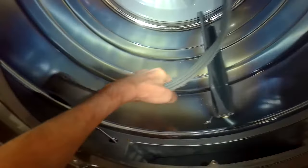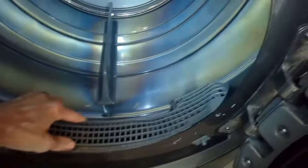You'll find a lot of lint in there. This is actually a design flaw with the Electrolux dryer that they haven't corrected yet — the vanes in the blower wheel are too close together, which causes it to jam up with lint. It still works, but it doesn't move air as well and it gets a bad rumbly sound.